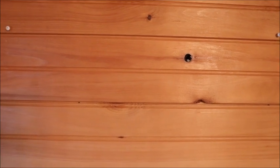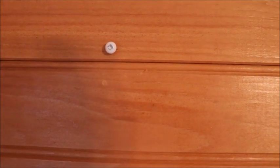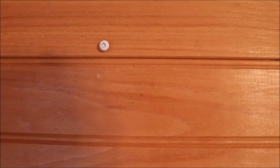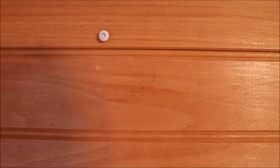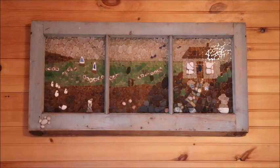I screwed two screws into the wall 22 inches apart, because it's a 35-inch wide piece, and if you look closely you can see it's going directly into the wall. Now if you're hanging something on a drywall be sure that if you don't have it going into a stud, you put a solid anchor there — but in wood these are going to hold really well. And there you go, you can see how nice this sea glass mosaic looks hung against this wooden wall.